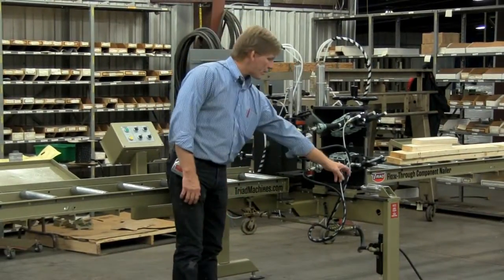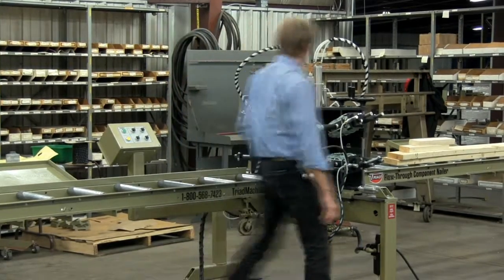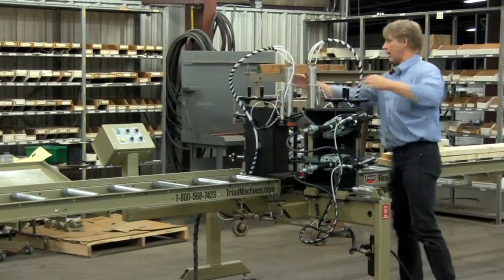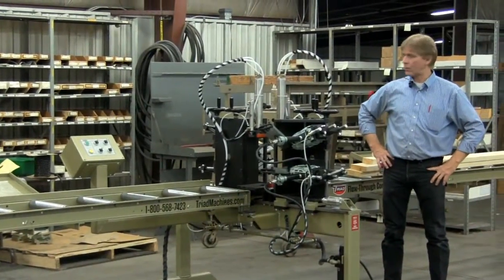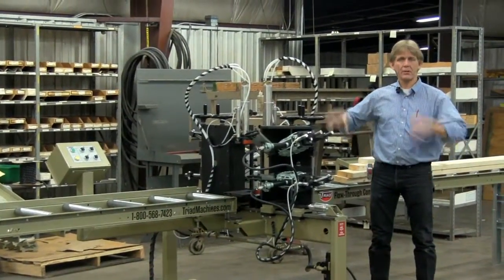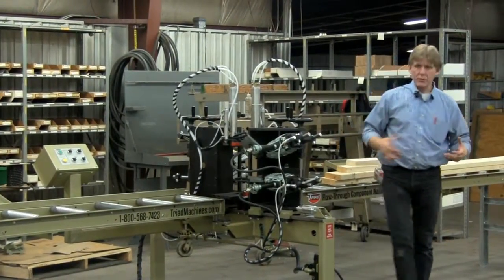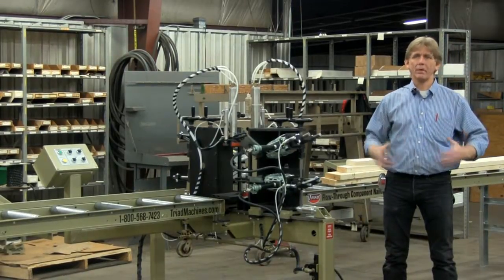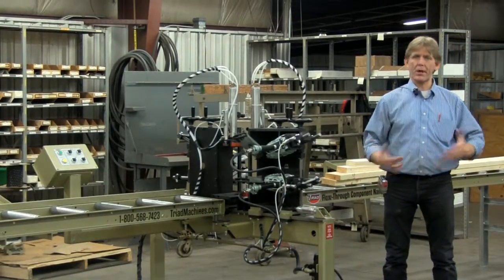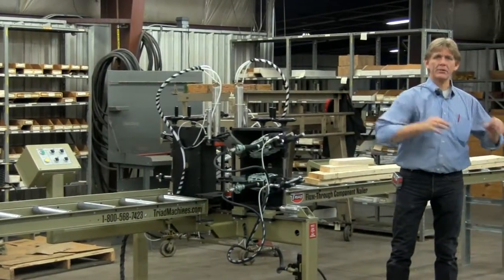You've got a cylinder stroking on this side and one on the back side, so we're coming in each time — works pretty slick, real smooth. You've got down clamps coming from the top. We're running about 100 psi and there's around 300 pounds of pressure coming down on the main cylinders, clamping your material. So try and use good material — it's a great chance to make good usable components that you can sell or put into your walls.